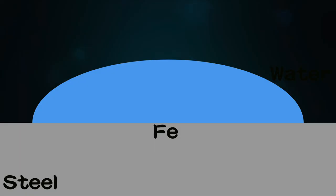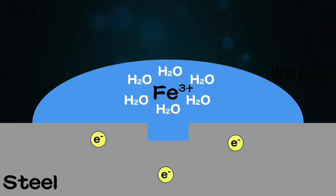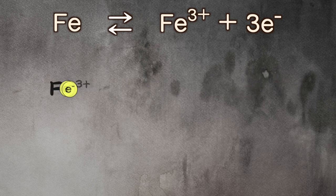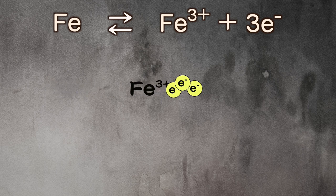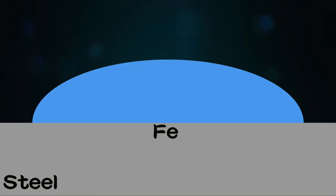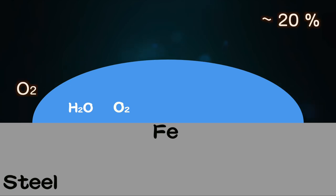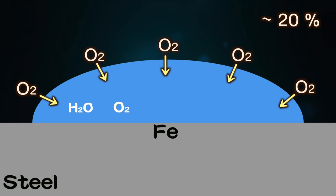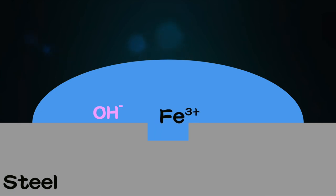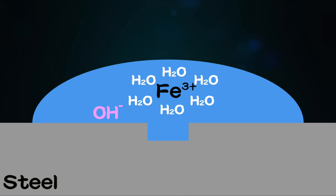The second reason is that water can act as a receiver of electrons. Even if water stabilizes ionized iron, that alone is not enough to cause rusting — there also needs to be a receiver of electrons. If electrons are not received by anyone, the reaction reverses back to Fe (iron). But if electrons are received by something, the reaction easily goes forward. Water and oxygen are the typical electron receivers. Since oxygen exists in the air, a certain percentage of O₂ is always dissolved in water. When both O₂ and H₂O receive electrons from iron, they form iron hydroxide — this is the initial reaction of rusting, and how iron dissolves in water. To summarize the reaction in one equation, it is like this.